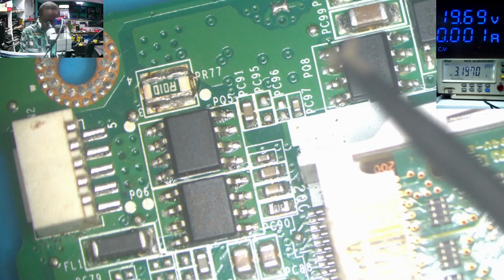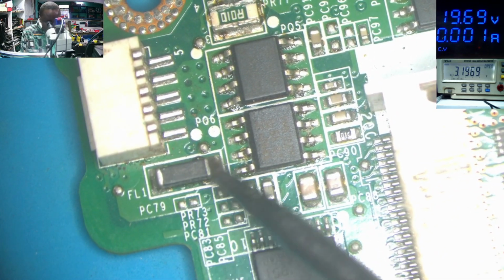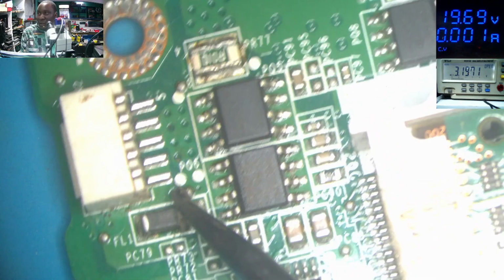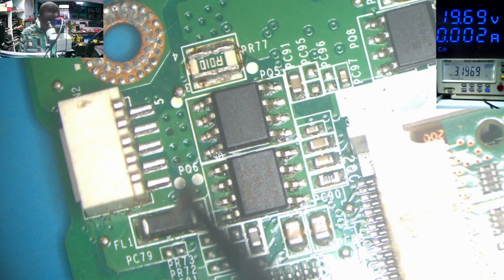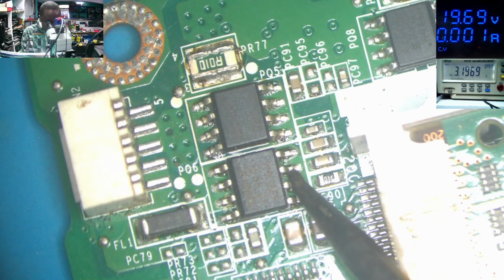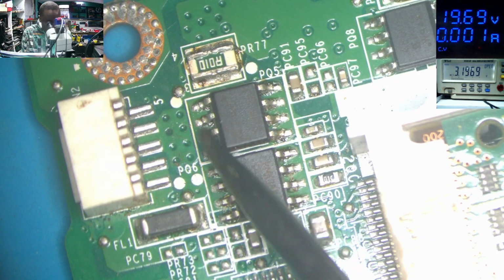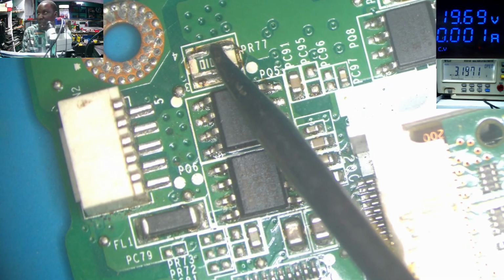So what do we have here? This is the charging port connector. And we have a long inductor here. This is just an inductor. So the plus is coming through this inductor. You see this black thing? After this it's passing through these three pins. That's the source, three pins together. That's the source of the MOSFET. And here on the output we have four pins together, the drain, and it's passing to these 4 pins at the drain, 3 pins on the output, and it's going to this current resistor. And from this point the voltage is going everywhere.